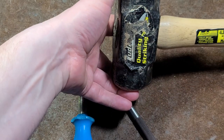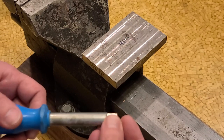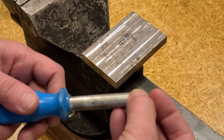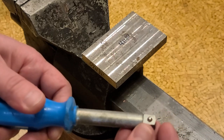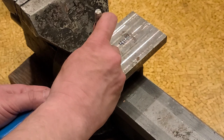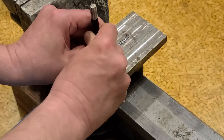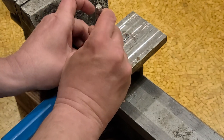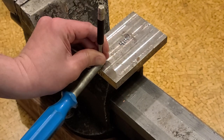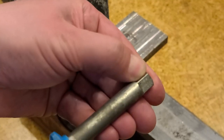I'm going to use a four-pounder right here. I'll drop the spring in — there's just a little bit of retention so it can barely hold the ball in place. Then I'm going to place the punch on the flat, not on the round part, making sure it's pretty well squared, and give it a tap to see if that worked at all.